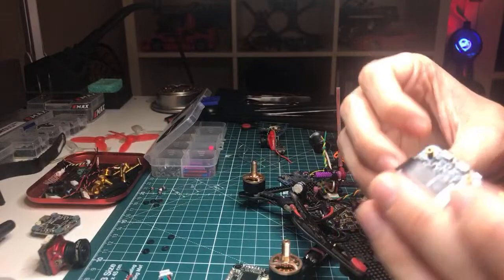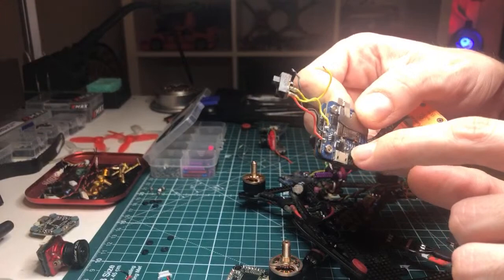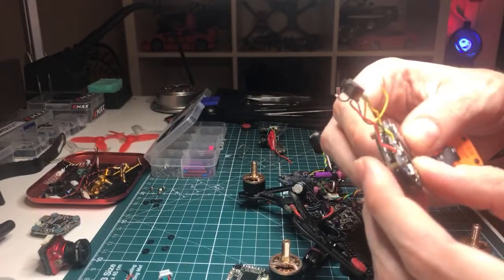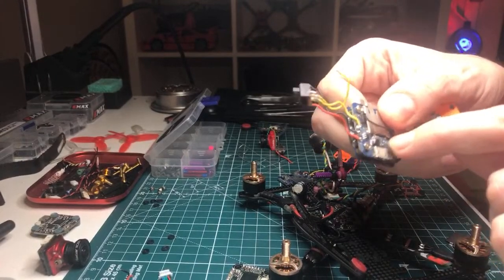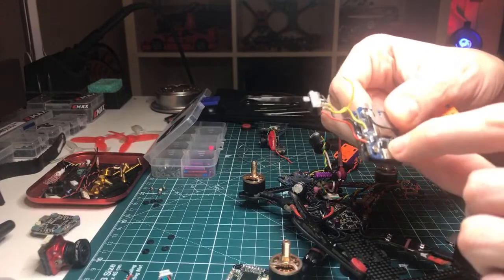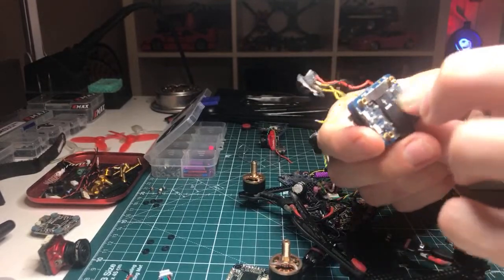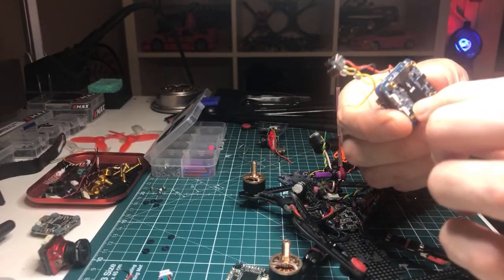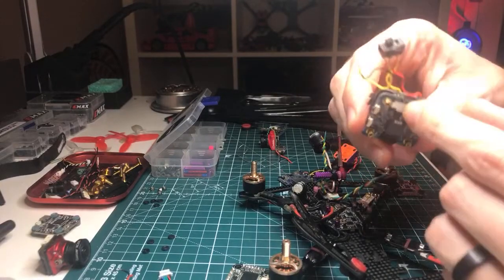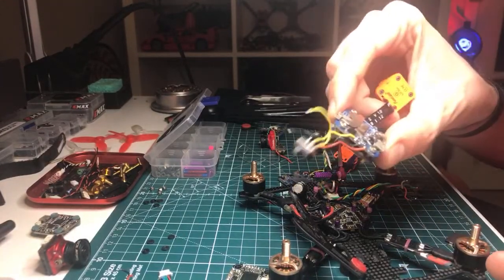So, yeah, if you're interested in the RunCam Split with some miles on it. Oh, here's the other thing I did too. I actually epoxied. This is a trick that Tommy told me really early on, when we were testing the prototype. I had maybe two of these double stacks fail when they were like Gen 1. And Tommy said one of the old tricks was to epoxy all the chips onto the board, basically. I did that, and it has been totally fine ever since. So it's got components epoxied down, which is pretty slick. So this should be super durable.